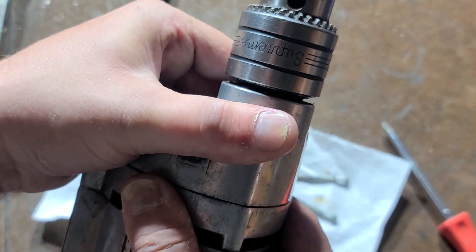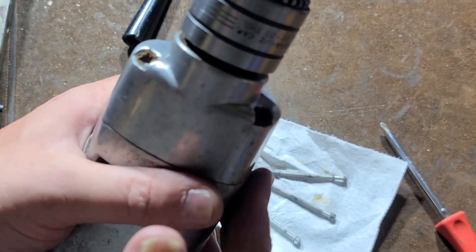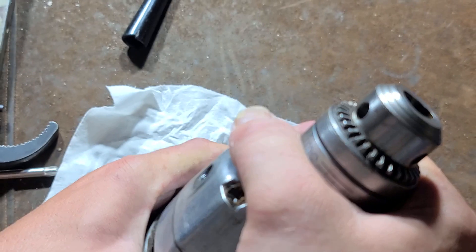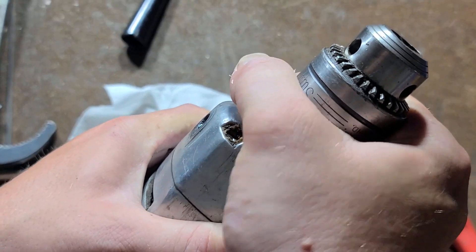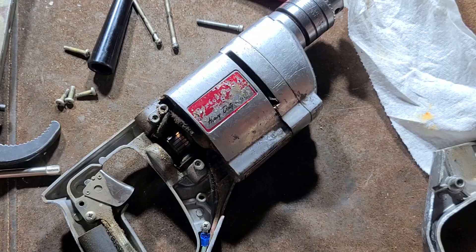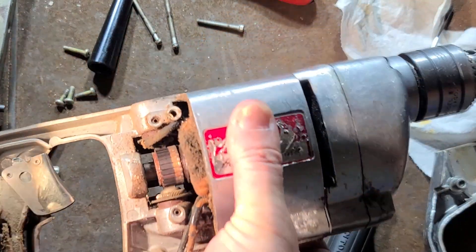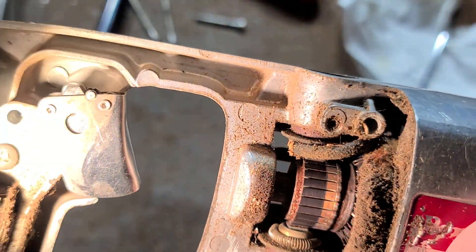Sometimes on these aluminum housing drills, these screws — because of a little bit of humidity and corrosion, these steel screws in the aluminum can just get locked in. When aluminum starts oxidizing it forms aluminum oxide — you've probably heard of it, it's used in grinding wheels and sandpaper. When aluminum oxide forms around the threads of a steel fastener it can lock them in pretty darn tight. These came out with relatively little fanfare. I'll try to work this gearbox — it obviously has not come apart in a long time, so it's just going to take a lot of wiggling and fudging.